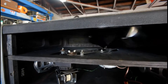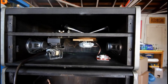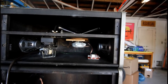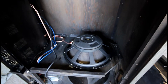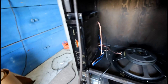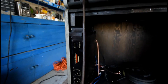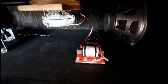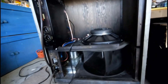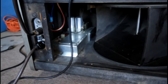I removed the reverb unit — it has a kind of chorus, I want to say like a vibrato generator or something. It's got an E140-8 JBL 8-ohm driver, a new Yamaha — I think it's a model P250 — it's a 100-watt 2-channel amp. I've got a Dayton 800 Hz 8-ohm crossover high-pass filter. Pretty much everything down here is left alone just for the motor control, which I'm going to eventually pull out.